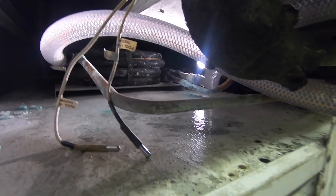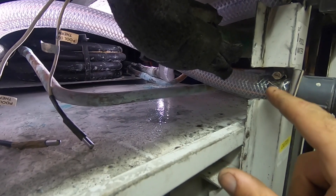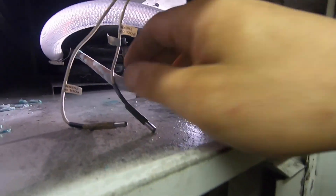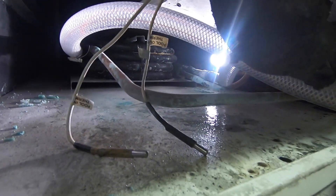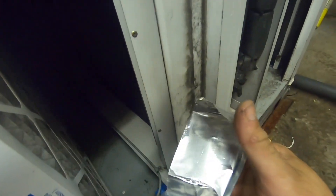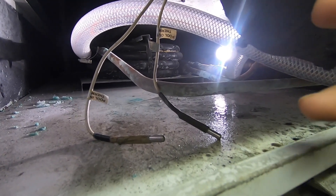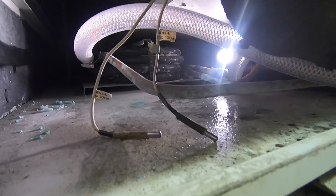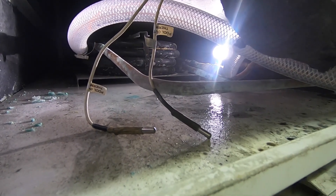They're both done. I don't know why they put hose clamps right in here - you can't get to them, so I have to cut this back a bit. I'll fix this back later. For these sensors, what I'm gonna do - I do this all the time and it works - I'll get aluminum foil tape, put it around the pipe so the heat disperses and holds the heat nice, put the sensor on, aluminum foil again, then insulation, then tape it again. That's good to go.